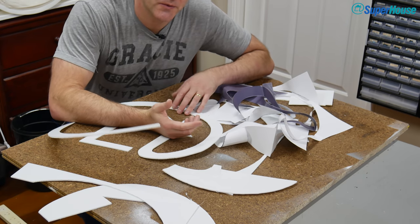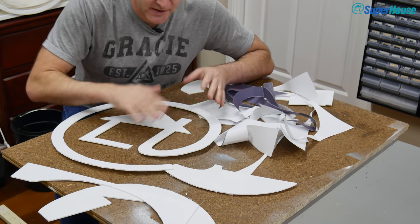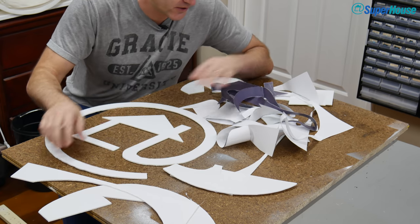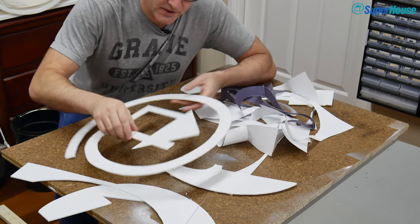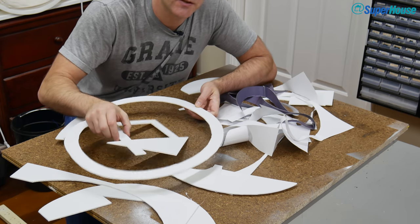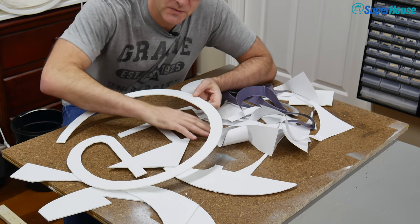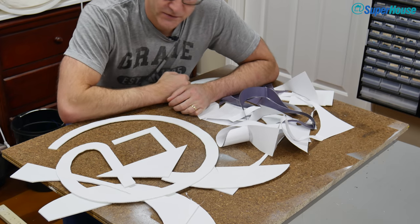Now I want to make sure I comply with this new law when it comes in. So I thought the easiest thing to do would be to start with just taking my logo and laser cutting it, maybe onto some MDF. And then what I could do is mount it on some standoffs over a backing board and put RGB LEDs along the back of it so that it's back illuminated. It would look pretty funky, be very easy, and wouldn't take very long.